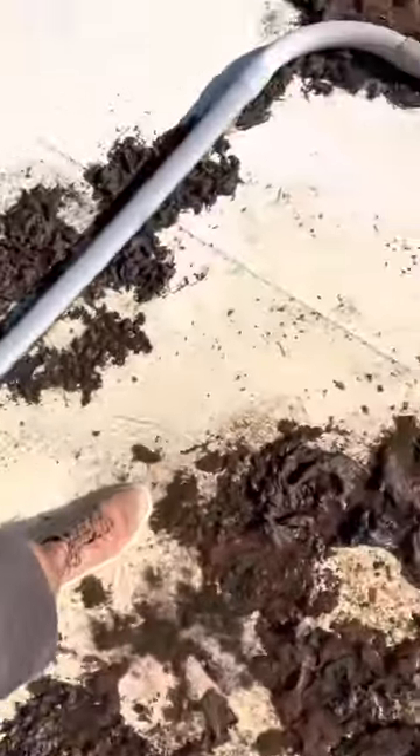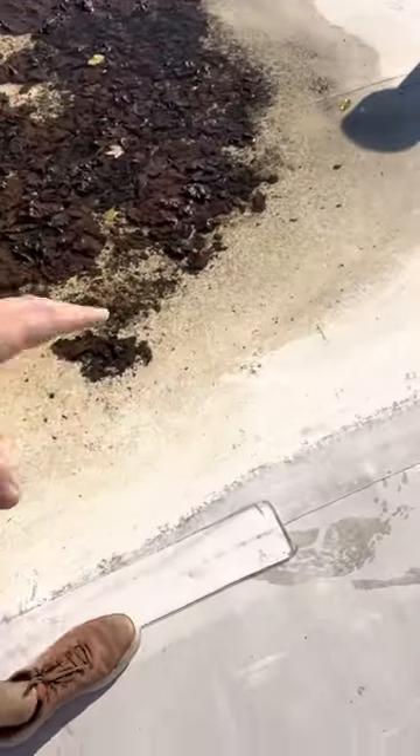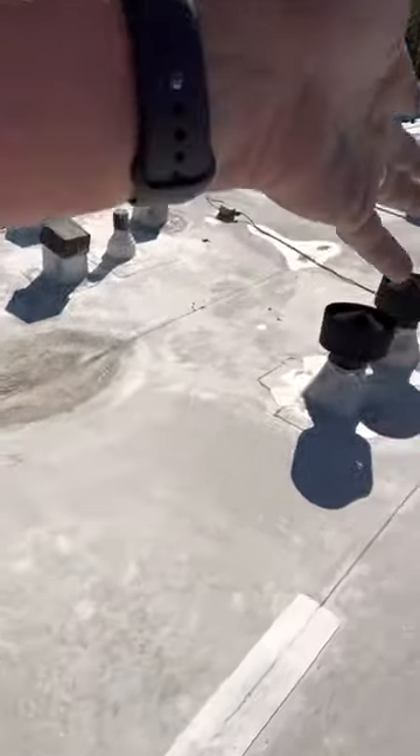To withstand the 220-pound test here doesn't necessarily mean this roof has to be good. But as you can see, I'm standing in a low, low, low spot — a sink of the roof that we were beginning to wonder if it might need a Tectum replacement. Although the deck of the roof isn't perfect, I think this is okay. You just saw me walk through this puddle, this pond. Right here we've got a high spot — kind of maybe raised because the Tectum sunk or the rafter of the roof dipped or something like that.